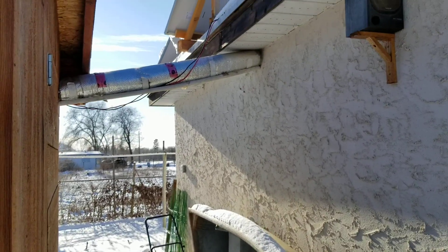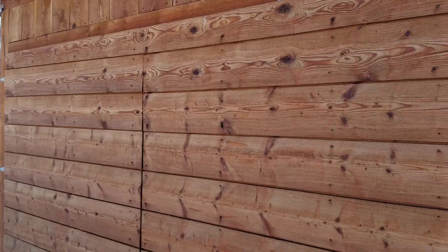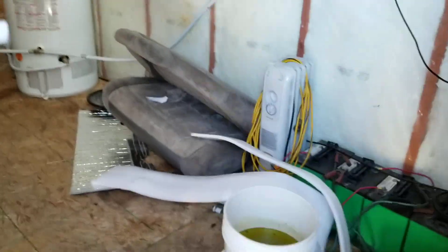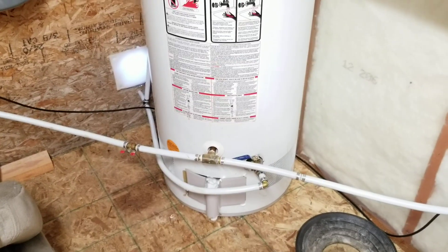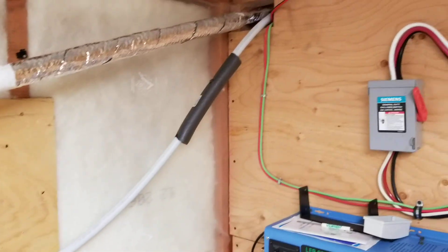As you can see, those are my boiler lines coming out of the shed — in and out. My solar panels are on top, and they go into my little boiler shed, which is basically a storage tank for holding the hot water. I had a 400 gallon tank in there but realized I didn't need that. My old gas hot water tank is now my storage tank. There's the hot line coming in, insulated, going into the hot water tank, and the water is circulated through a line that comes back out.